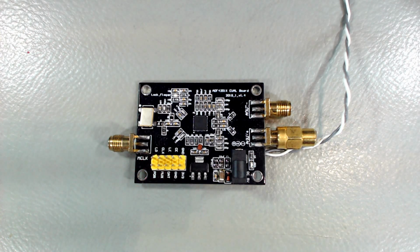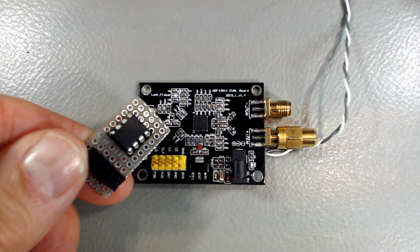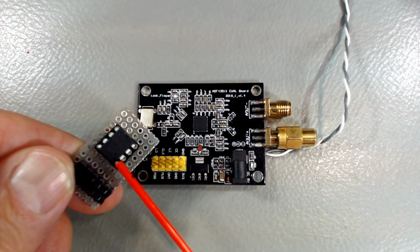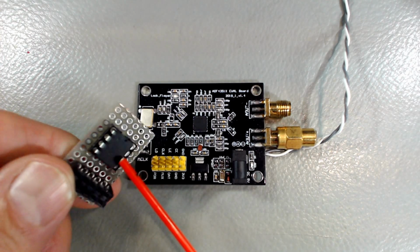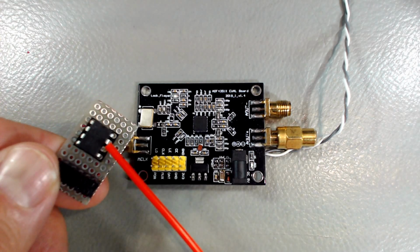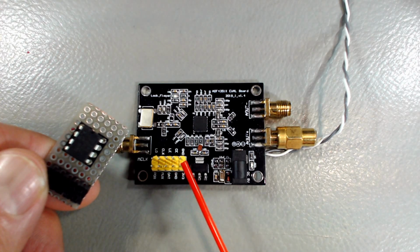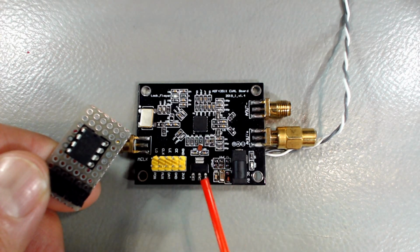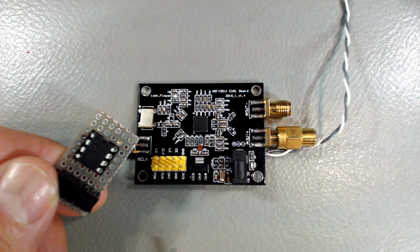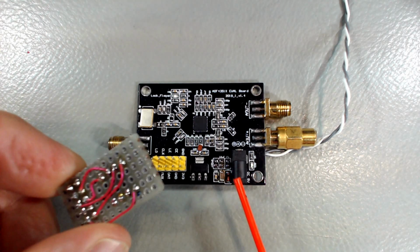And for doing so, I've put together this little board. It's a little 8-pin microcontroller, a PIC12F683. That is simply routed to a 2x5 connector, and I programmed this chip, of course, to send the right configuration words to the chip to set our frequency to 3408 megahertz, of course. So that's what it takes, really. It's not a lot, but it has to be created.